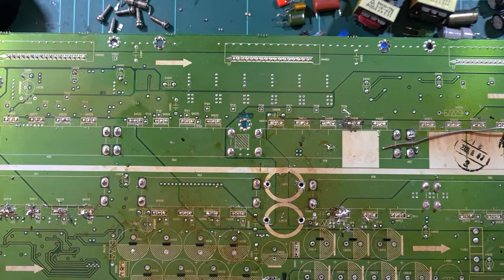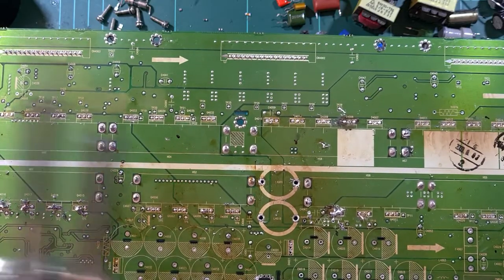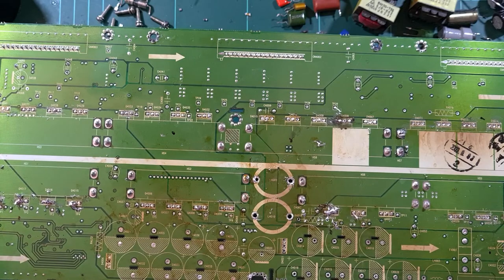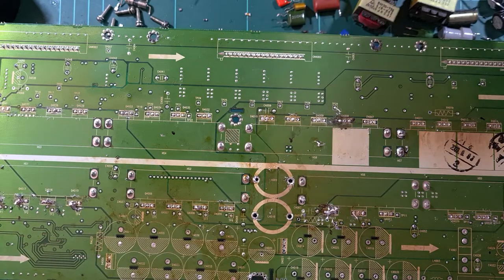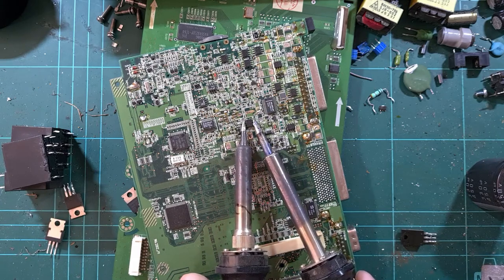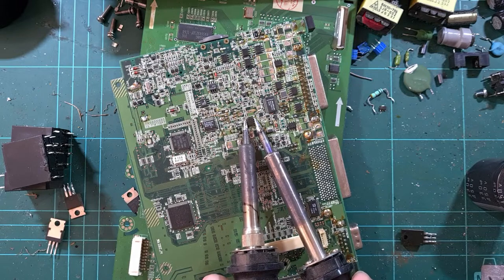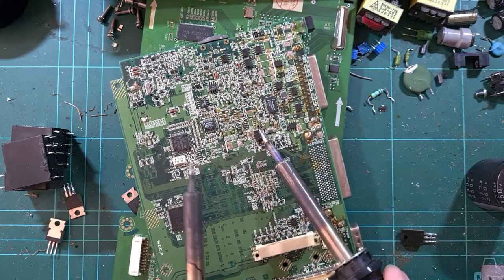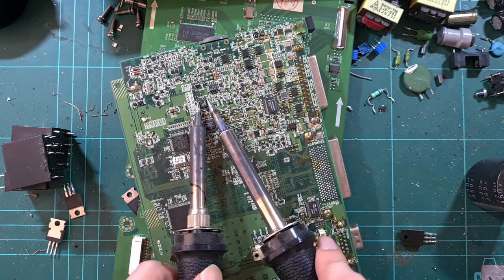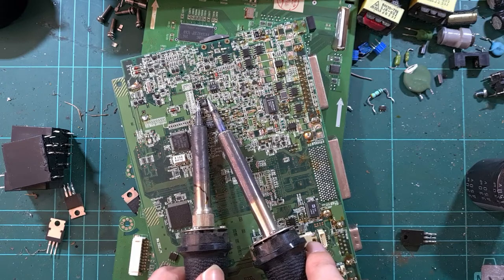Twin irons can help you out massively when dealing with power transistors. They can just drop off the board. Surface mount components are a completely different ball game, but with surface mount boards, this technique works a lot easier. By going on either side of the component, running up and down, you can get surface mount chips off the board. Yes, you do kind of have to fling them off the iron as they will stick, but for the most part, you can get them off pretty easy.